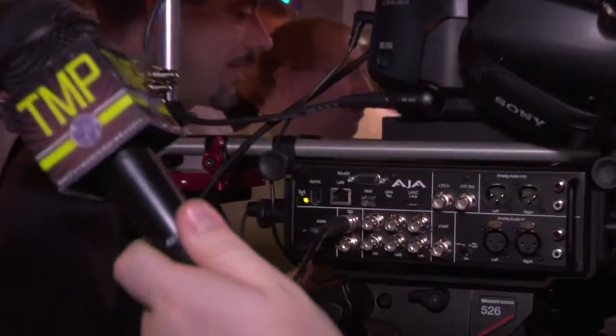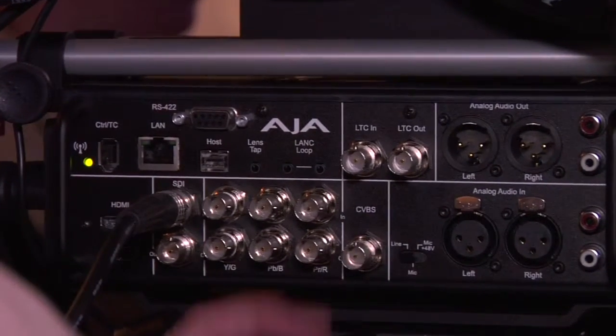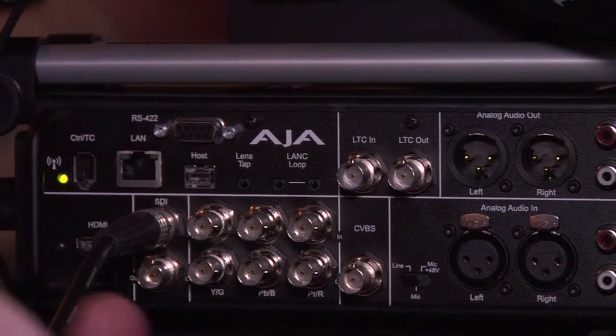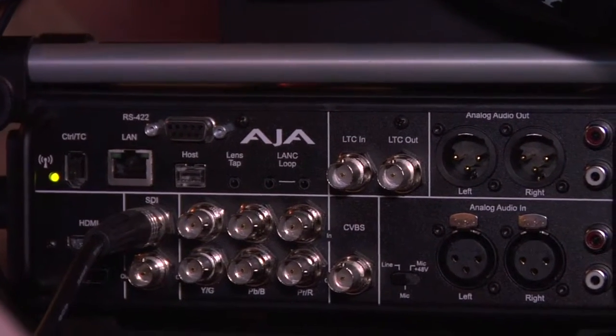Right, and so what can you actually connect to this camera? Obviously, you've got an HDSDI port, you said a component port. As I turn it around here, we actually have everything. It has HDSDI, component, HDMI in and out. We also offer a composite tap, just so there's some way in and out. But the best part about it is LTC timecode. As we go to smaller and smaller cameras in the RAW world, we've got to be able to have camera timecode. And being able to import that data means that I have a native file on my card, my disk, whatever my media is, my tape, and I have that same timecode in ProRes 10-bit. So I have my master archive, plus I have an even better copy of the original.